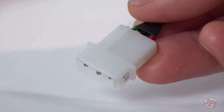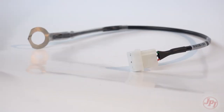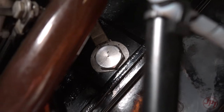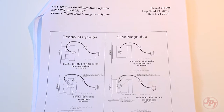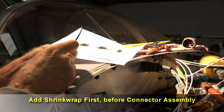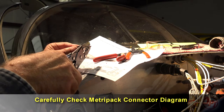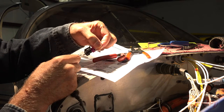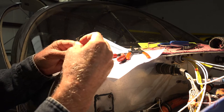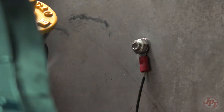For the RPM installation, use the J3 connector harness and connect the three leads using the supplied 3-pin connector end pins. There are four types of magnetos commonly in use — check the diagram to match yours. Remember to use shrink wrap on the wires first, before adding any connectors. Follow the wire instructions exactly using the proper crimping tools and technique. Remember to ground the instrument to the engine, not the avionics ground — this is critical and can cause problems and wasted troubleshooting time.